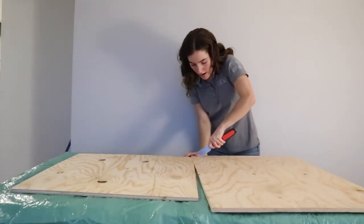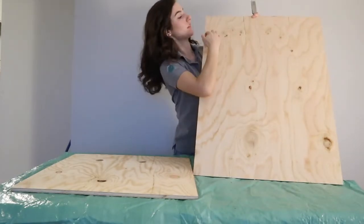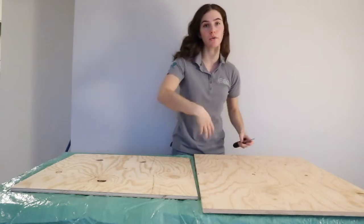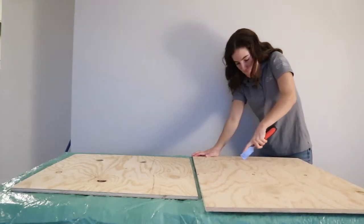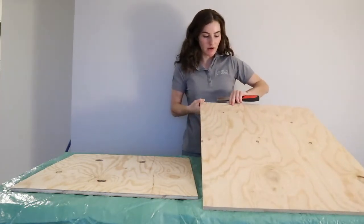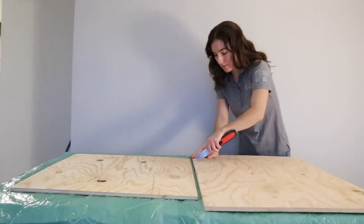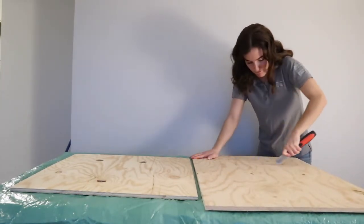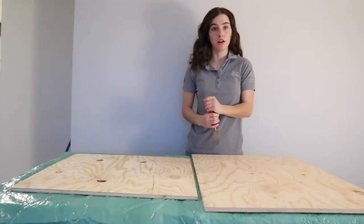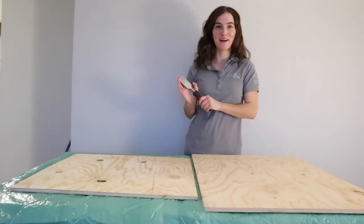For scratching, I'm taking a chisel and going down and across. You want to make sure that the scratches are horizontal with the plank so that the bats can hang — you don't want them going vertical. Continue that all the way down the length of the box. The spacing doesn't matter too much, but ensure you have enough scratches down the whole length. The deeper you can make them the better. If you have a saw and can do this with a machine that would be ideal, but a chisel and some muscle will work just fine.